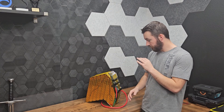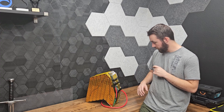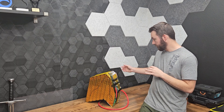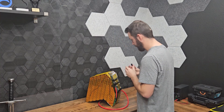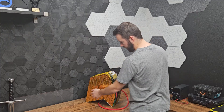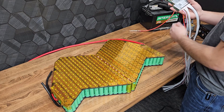I'll be charging at about 20 amps usually, and then it drops to 10 amps after it gets to 4.1 volts. For starters, your general wiring consists of three connections on each side. I did my negative wires as three separate wires that come up and attach to the three different terminals, and then my positive off of the battery runs straight to the controller — no BMS. The wire coming back from the controller hooks to these three posts on this side, and up here you have all your balancing wires and temp sensors.